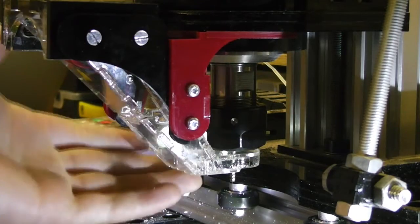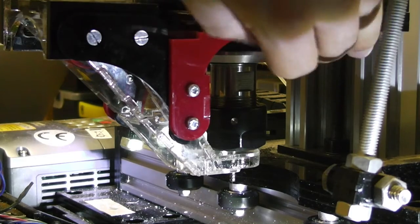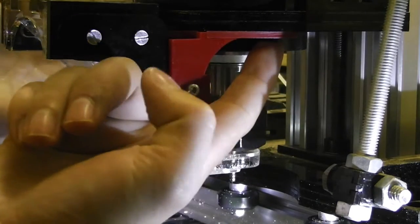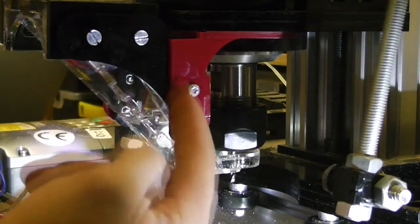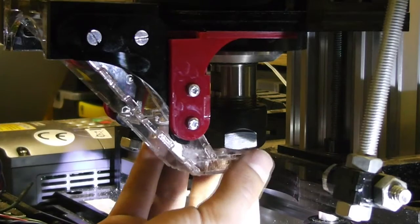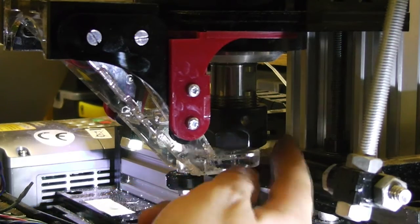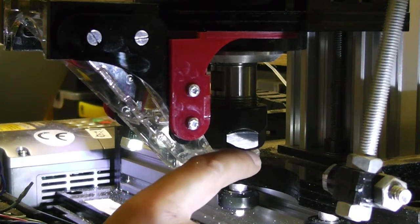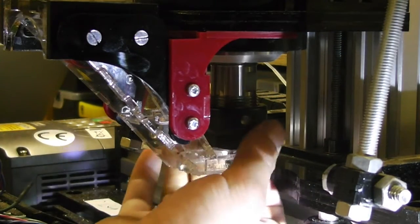I've attached the new extraction fitting onto the bottom of the spindle mount, attached with self-tapping screws screwing into the acrylic of the spindle carriage. It's a pretty good fit. I was able to adjust the height and move the whole thing in or out using these screws. I've got it more or less centred on the router bit now. Although it's very close to the bottom of the spindle, it's all turning freely and there's about a 1 to 1.5mm gap at the bottom, so it shouldn't actually meet the spinning base of the router at all.